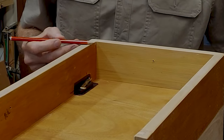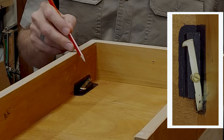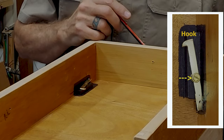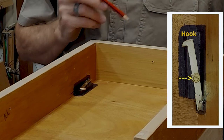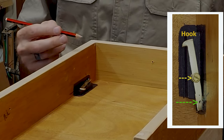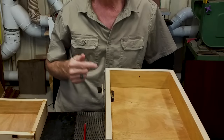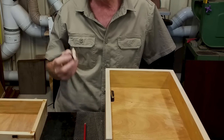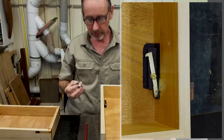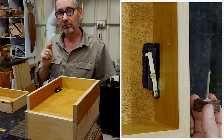Quick tour of how the latch works: I made a hook from 2mm brass plate, cut into a 12mm wide by about 50mm long strip on the bandsaw, shaped into a hook with smoothed edges. I found the centre of the brass and drilled a hole as the latch pivot point, then screwed through the brass and riser block into the underneath of the main drawer. At the end of the brass latch I drilled another hole where the spring attaches. The spring goes through the front of the drawer and is held in place with a pin. The spring holds the latch in the lock position all the time and is strong enough to return the magic button to the front of the drawer. When the magic button and pushrod are pushed through, they strike the back of the latch, push it out of the way, and release the drawer.